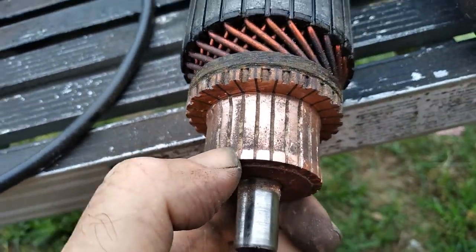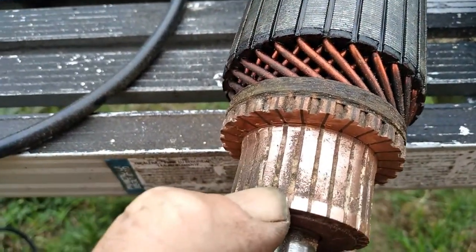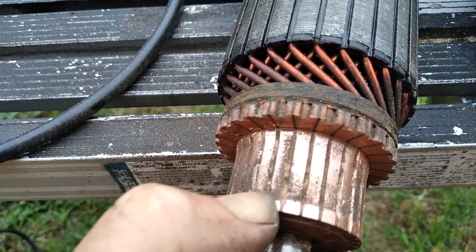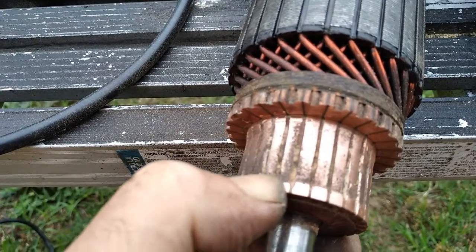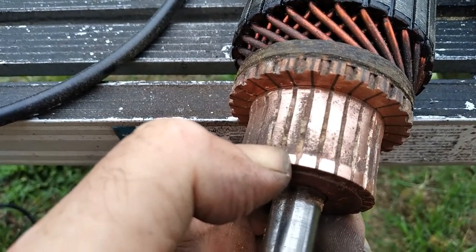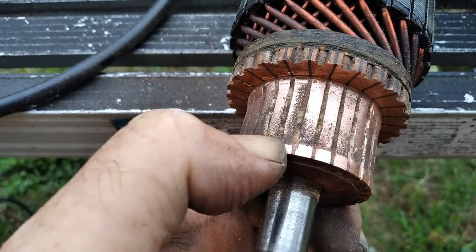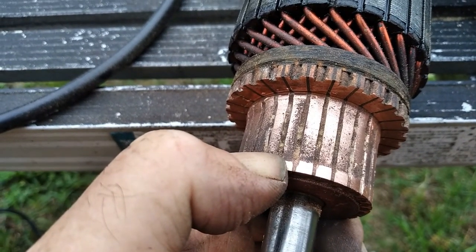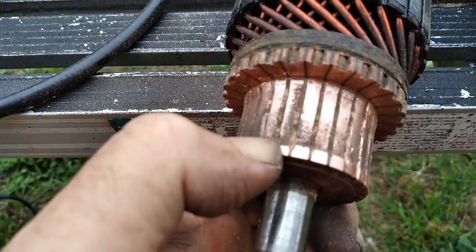Like I said, this thing was completely coated inside with oil, and I've had the kerosene sitting in there since yesterday in the bell housing. We'll drain it out, or maybe start it. Once we get it started, we'll run it with the diesel or kerosene in there a little while, and then drain it out and put some lacquer thinner or brake clean on the clutch disc to try and get any rest of the goo off of it. Really, you want it as dry as can be because it is a dry clutch.